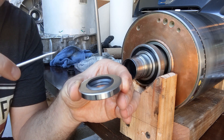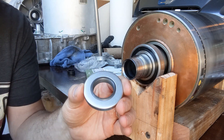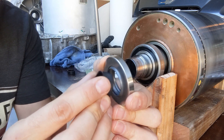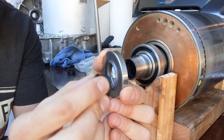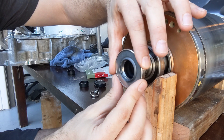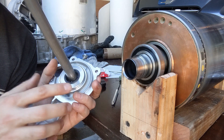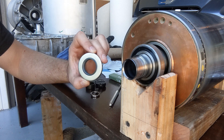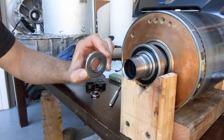That left two permanent nicks there and there. What is better is before you mount it, you try to expand the diameter of the excluder lip. Imagine this is the shaft — you push the lip out like this in all directions along the circumference. After that it is much easier to mount it. Also, one handbook from a seal manufacturer stated that it is quite normal for a beginner to damage and ruin a bunch of seals before you get it right, so maybe it's a good idea to order multiple.